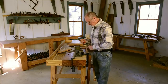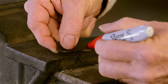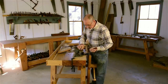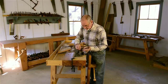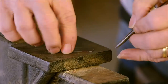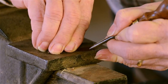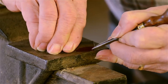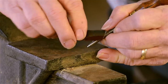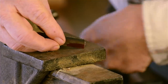The first step would be to take a marker of some kind and simply darken the area that you're going to be working on. Next, take a scribe — I'll just do this freehand for the purposes of the demonstration, but you might have a section of molding that you'd want to stand up and scribe around so that you get the exact shape you're wanting to copy. You would take your scribe and scratch a line through that marker that you've darkened the metal with. It's kind of hard to see that line because it's such a fine mark, but that gives you the line to go by.